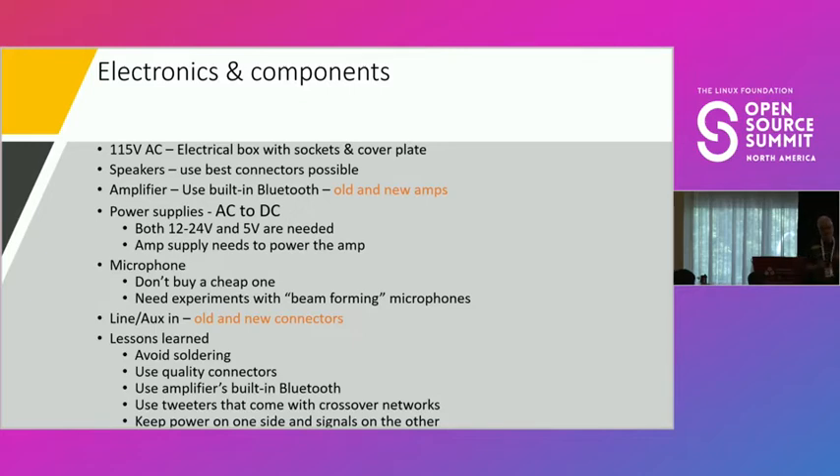The current amp is rated at 30 watts per left and right channel and 60 watts for the subwoofer — 120 watts total — so you'd need a 132-watt power supply to actually achieve 120 watts out. The bigger model is rated at 50+50+100 watts, requiring a 220-watt power supply. We went with 24 volts times 5 amps, about 120 watts, so realistically about 110 watts out — but that easily fills a room. For microphones, don't buy cheap ones. Amazon Alexa and Google Home use beam-forming arrays of four to six microphones; we've just gone with a single quality microphone.